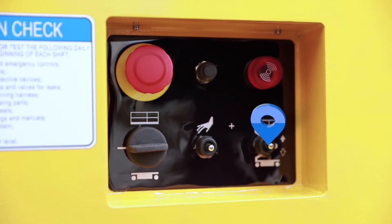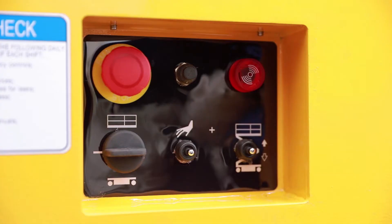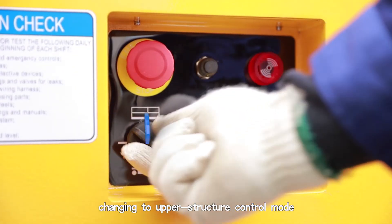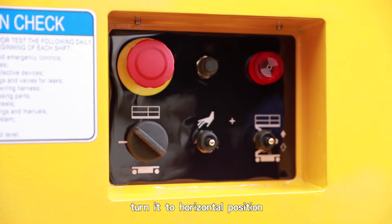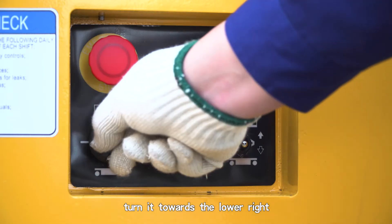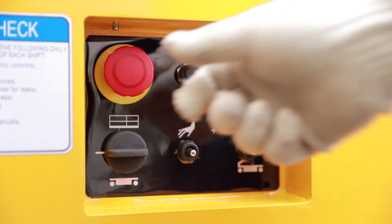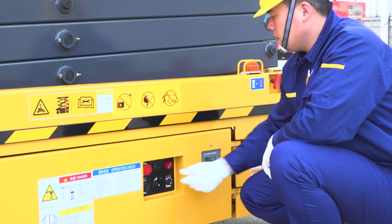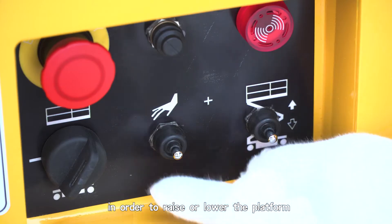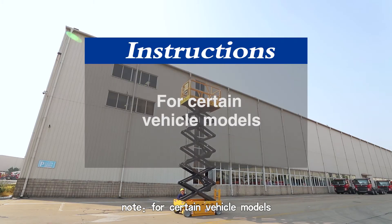Up-Down Switch and Timer — used to record how long the machine has worked. Key switch has three gears: with the machine powered on, turn it toward the upper right to change to upper structure control mode; turn it to horizontal position to cut off the main power of the machine; turn it toward the lower right to change to under carriage control mode. E-Stop Switch: press it down or pull it out in an emergency to immediately shut down the machine. To raise or lower the platform, you must toggle the under carriage control switch upward and the up-down switch at the same time.